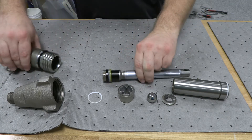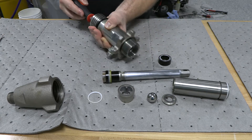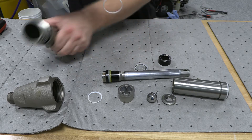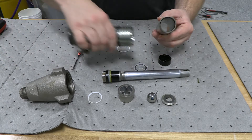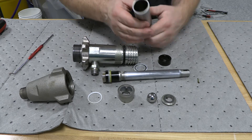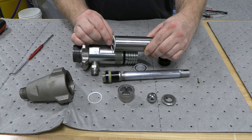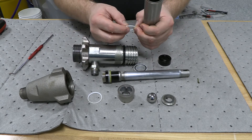It's a pretty easy, pretty simple pump. On the top side you've got a spacer, and then you've got your seal. Down inside of this you've got another white Teflon seal. If you are taking this lower cone off just to check those check balls, be very careful that this sleeve does not slide out of the housing, because this Teflon ring is what's on top of it. You can put it in easy by pushing it up there, but there's no lip to hold it in place. If that sleeve starts to come down, this thing can turn sideways. If you push it back up in there misaligned and tighten that up, you're going to flatten this out and your pump's going to leak.